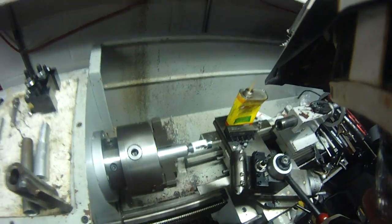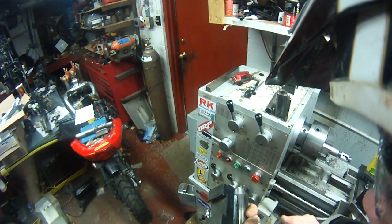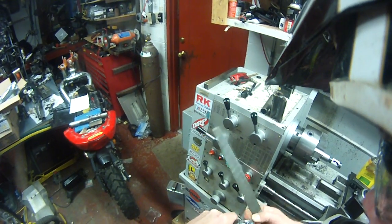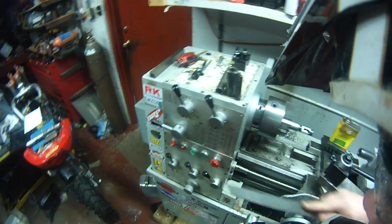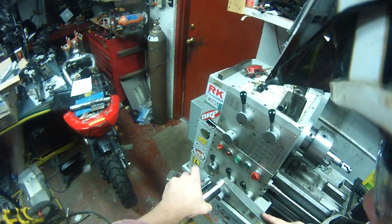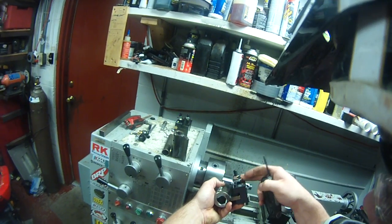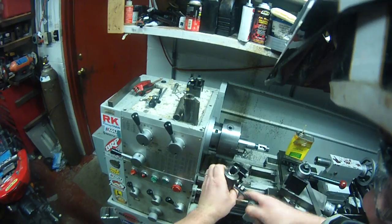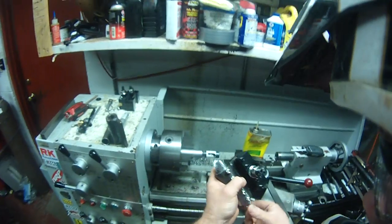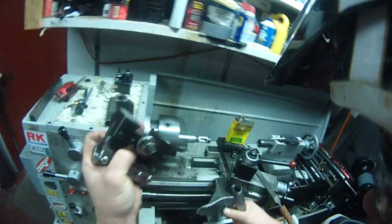So that's it. The nice thing is this whole thing just popped right off. Got a little ear there — that probably means I was just a little bit off center, which is fine. Because the nice thing about this is you can adjust it really fine just by using the wheel. It should be able to come out now, just by using up and down, just like that. I definitely need to take a couple thousandths out of that because that's going to get old quick.